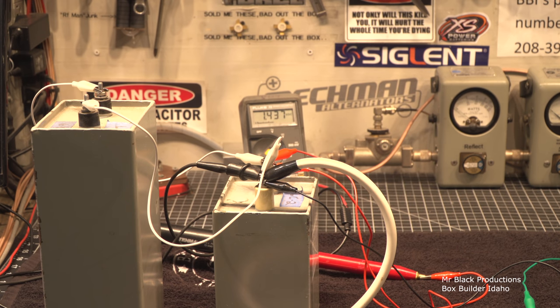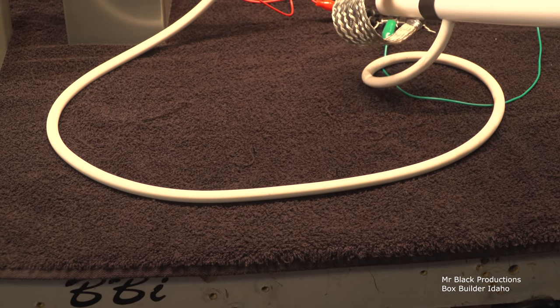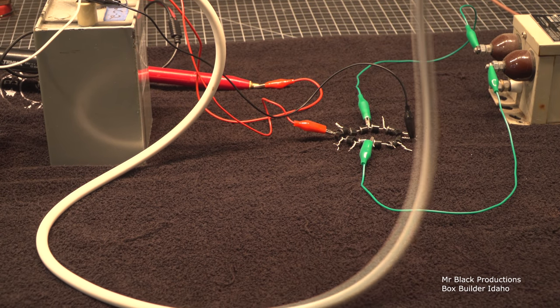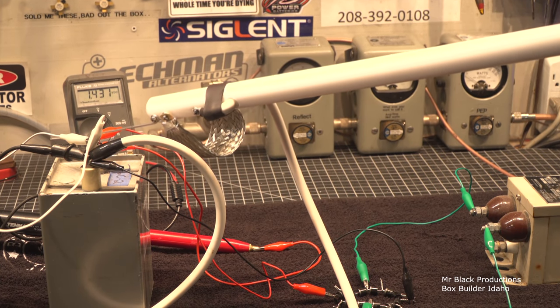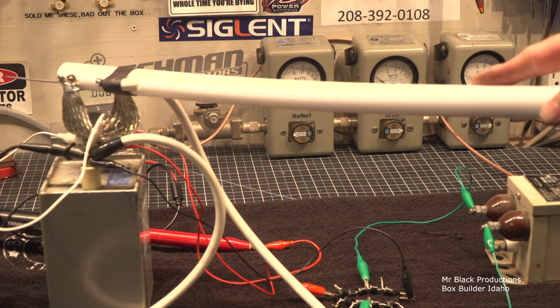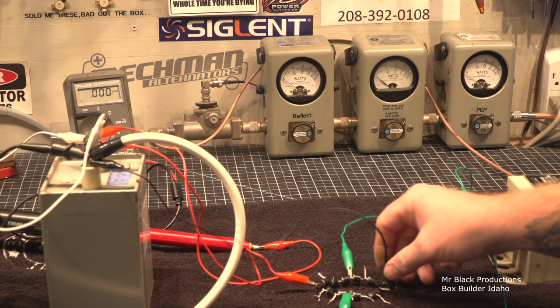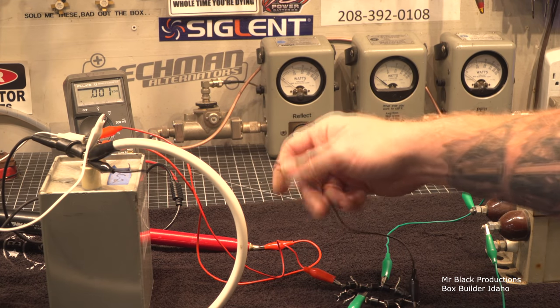Ooh, I spot something potentially dangerous. See that lead? Nope, you can't see the lead. See that lead? They're actually touching. So we're at 1400 volts. Let's go in here and let's neutralize our circuit. Ground, ground, ground, ground, ground. Don't get in a hurry. Now we're free to stick our fingers in there without locking the circuit out for a second or two.